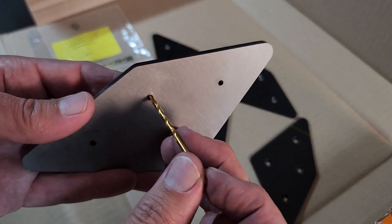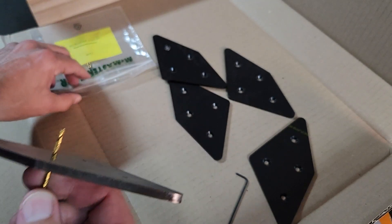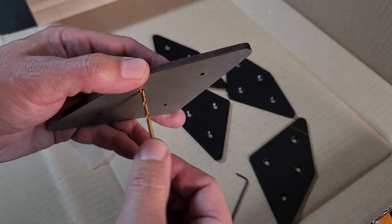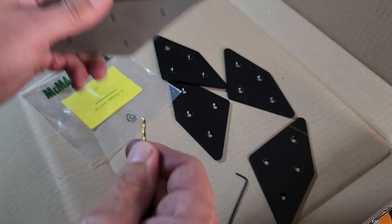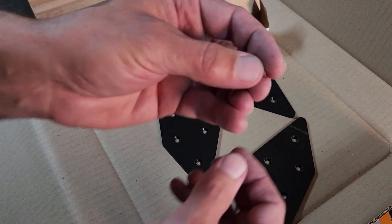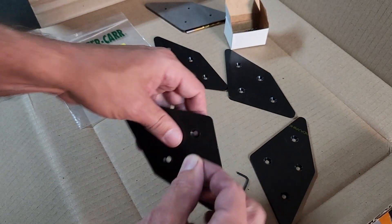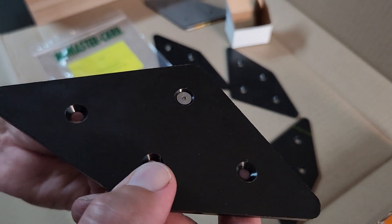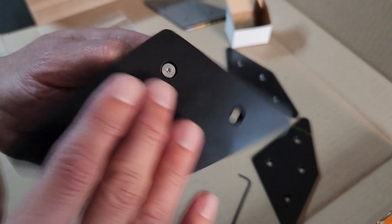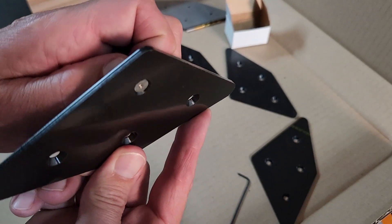First things first — our drill template is perfect. These drill bits I got from McMaster-Carr; that's also where I got my taps, because you can get the perfect size drill bit for the tap you're going to use. I went with size six hex head fasteners — they're super tiny, but check out the elevation. That's what I wanted: something with some depth so we can give ourselves time to wear out the Delrin. And even if you scratch the hole, you can still get an Allen wrench in there.